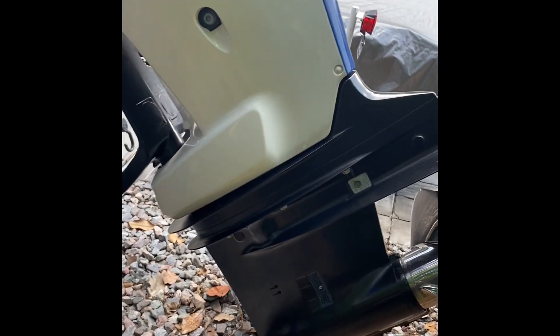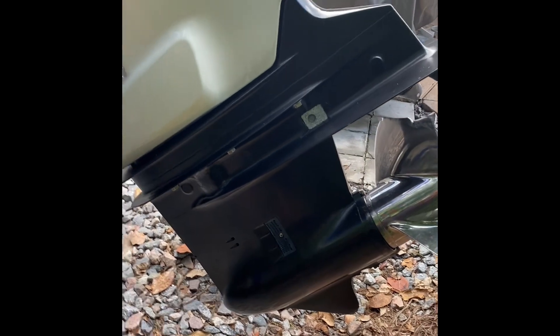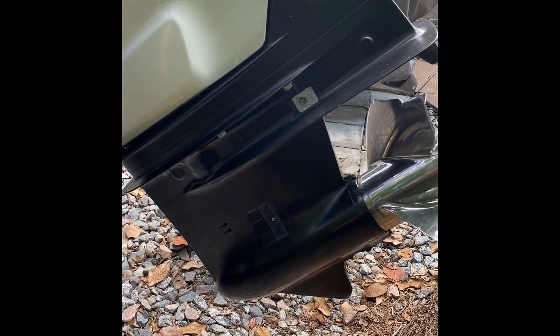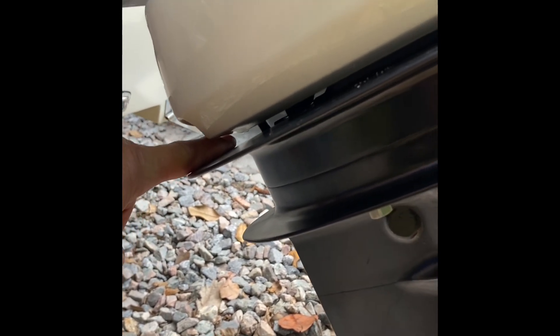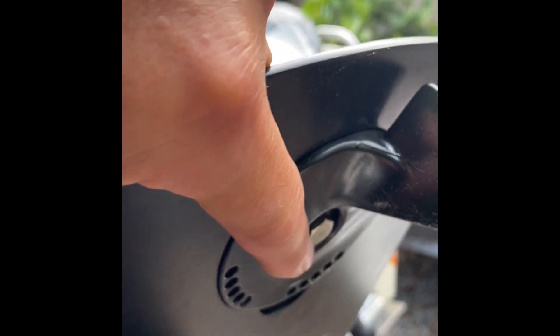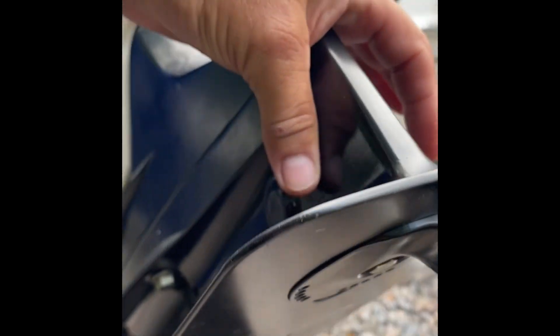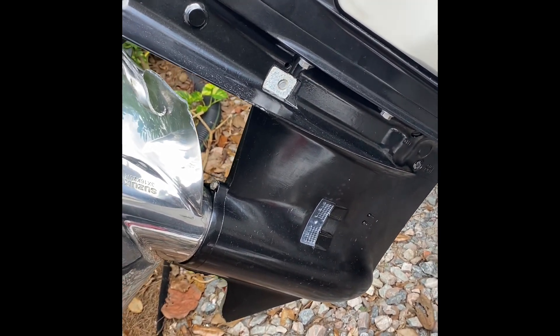We're at the engine. I just had it repainted — this is a 2015 DF250 and you could eat off this engine, I keep it very well maintained. What we've got to do now is take the lower unit off so I can check if there's any more damage up on the driveline. It's easy to take off. There's a tube with a zip tie right up here that you'll have to disconnect with needle nose pliers. You've got three 14-millimeter bolts on each side. You've got your trim tab — that's a 12-millimeter you've got to remove. And then there's another bolt inside you'll need a deep-well socket for, I think that's 15-millimeter. Three more bolts on the other side, and then the whole lower unit just drops out.